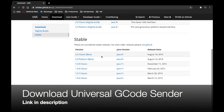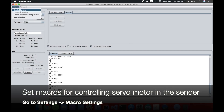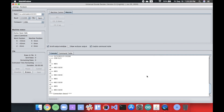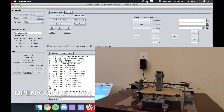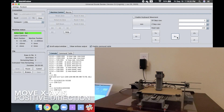Next, download the Universal G-code Sender — I'll leave a link in the description. Then go to Settings, Macro Settings in the G-code sender, and add two macros for Z down and Z up. The commands M03 S30 and M05 indicate up and down for the servo motor. Then, making sure that the port is the same as the one you saw in the Arduino IDE, click Open to open a connection. Then you can use the individual plus and minus buttons for the X and Y axes to test that the motors are working.